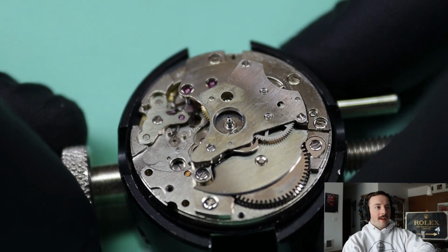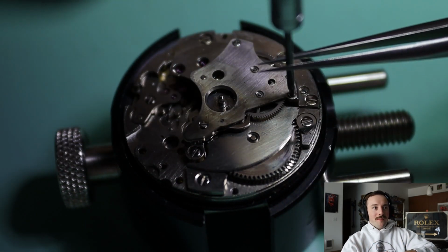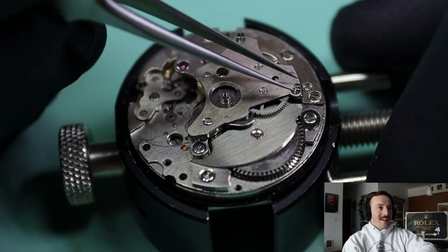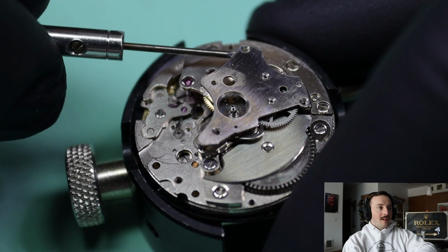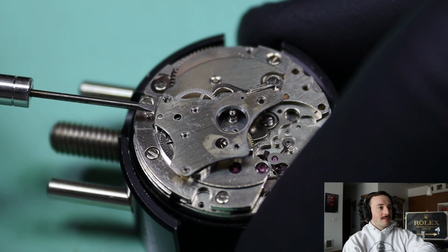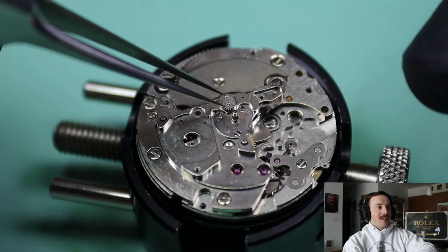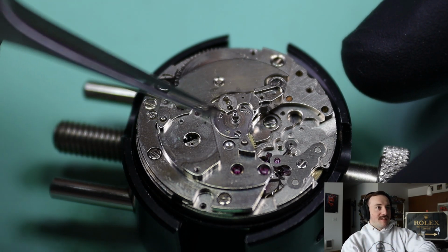This is actually a really simple automatic system, which is really nice. A lot of times they're wonky because different companies have different patents and everybody tried to improve the way the reverser wheels were, and they probably could have just used that Seiko magic lever, but besides the point, this is Swiss and before all that, and this had a reverser wheel. Take this main plate off, or this main automatic plate off. There's everything goes flying. I've removed the click to the automatic ratchet. And there's that little reverser wheel, kind of sliding action wheel.